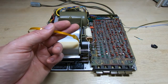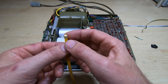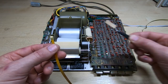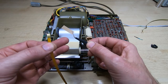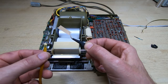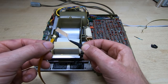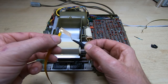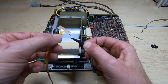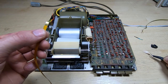And on the far end, what I decided to do was to just terminate this in gold contacts, and I'm going to use some special conductive tape. So this is not blanket conductive, it's not a sheet of conductive film, it's a series of very small conductive paths, a bit like a zebra strip on an LCD display, but the conductors are very fine dots rather than stripes.